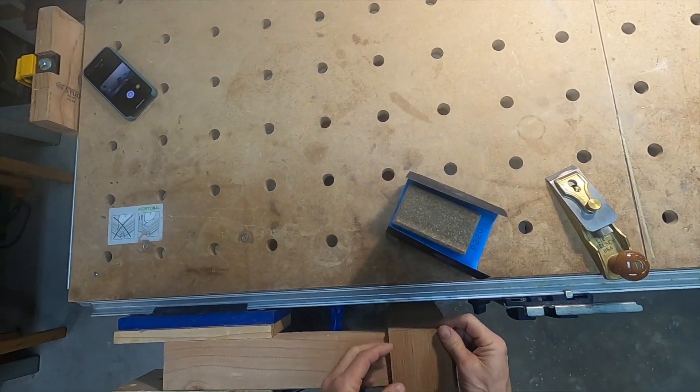So we've done one corner, let me get this corner now. It's not off by much but I may use this chisel plane to get the glue off. I'm cutting on a skew and not just pushing directly against it - I'm sliding it like you would slice with a knife. And that's how I'm using that; this will get all that glue that's above the surface off too. All right, that looks good. Now let's see if there's some glue on this side as well - this is where I had to fill that corner in.